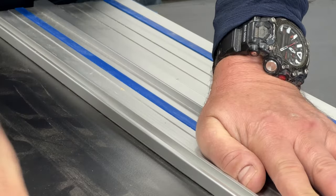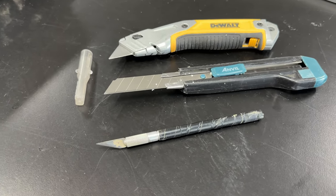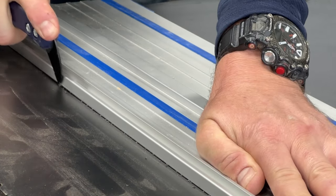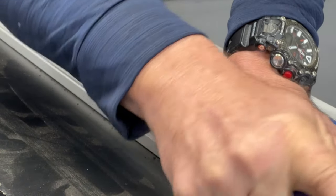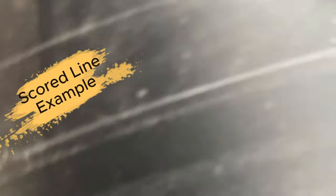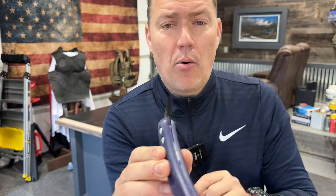There's also a scoring knife, and this is something you can honestly get for about $7.99. A lot of people say you can use a carpenter knife or an exacto knife, and that is true. But what I've found is this is a very rigid blade. You want something that doesn't have a lot of deflection — when you pull on a blade, you don't want it to bend a lot — because it's going to allow you to prevent it from walking. It's a rigid blade with a blunt end that works its way down to a point.